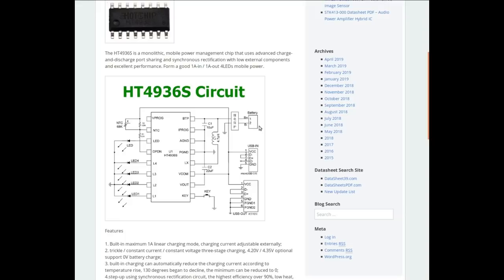So here we've got pretty much what we expected: battery plus and minus. Battery plus goes to BTP and also feeds through the inductor to LX — 'L' being a common name for an inductor terminal. The five volts for input and output share a common node going to voltage common and voltage output, with a capacitor to ground. Those also go through a little NTC thermistor — a temperature sensing component — into the NTC input. There's also a DP/DN pin, possibly power-down detect.